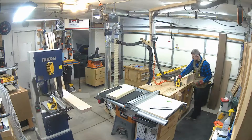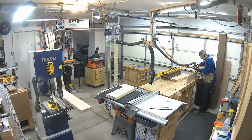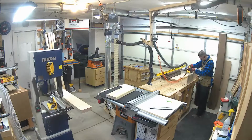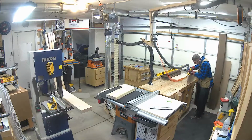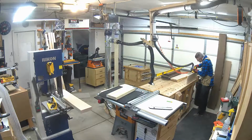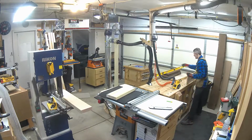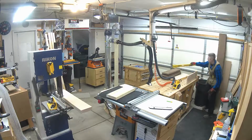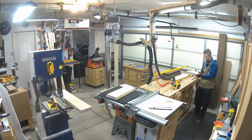After I initially cut down my lumber to rough length, I'm using a handheld planer to get one of the edges roughly straight. After this, I will go to the bandsaw and cut everything to rough width. But I would like one of the edges to be fairly flat, so I'm not cutting a big banana in all my boards. And instead of running them across the jointer, I'm just using the handheld one here, just to quickly flatten things out.